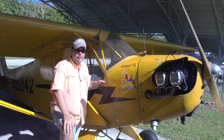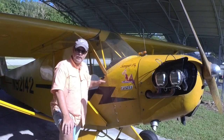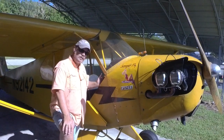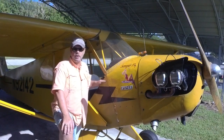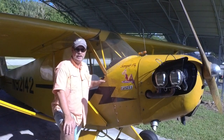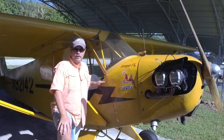And my father, who had been around airplanes like these since he was a little kid too, always said, don't ever touch the prop, because you don't know where the mag switch is set, or even if the mag switch is set off, you don't know that it's an old corroded one, so there's not actually a ground going to the mags. The mags aren't grounded, no matter what the switch says. If you turn the prop, you'll get a spark.